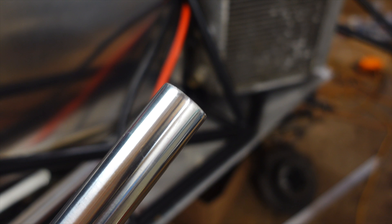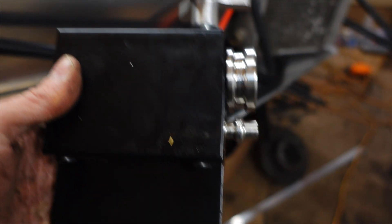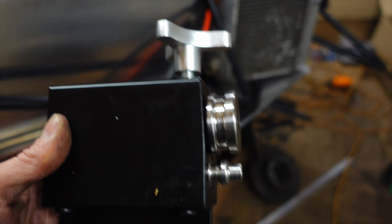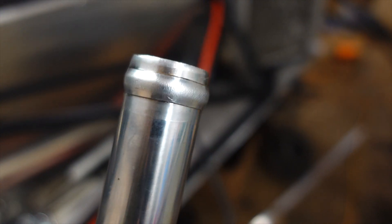I picked up some pipe but as you can see at the end, it doesn't have a bead on it, and I'm very worried about blowing pipes off. So I've made a bead — I picked up this beading tool. You just crank the nut at the top down and that squeezes the two rollers together and creates a bead on the pipe. For my first attempt, it's not perfect but it's pretty good.